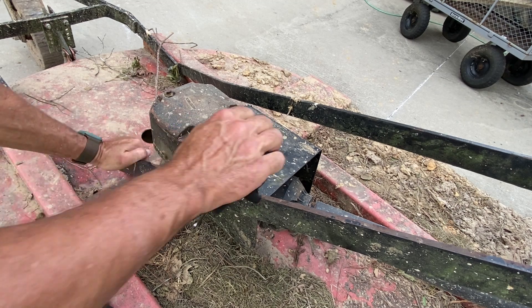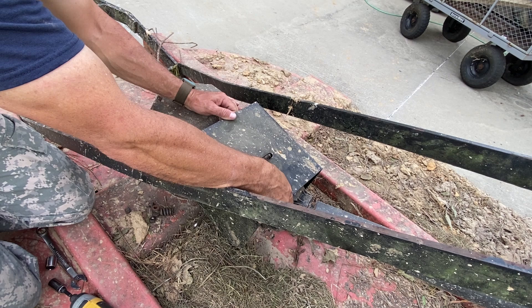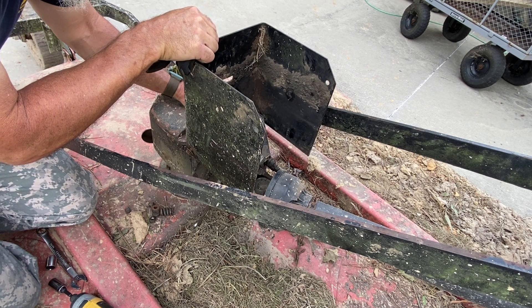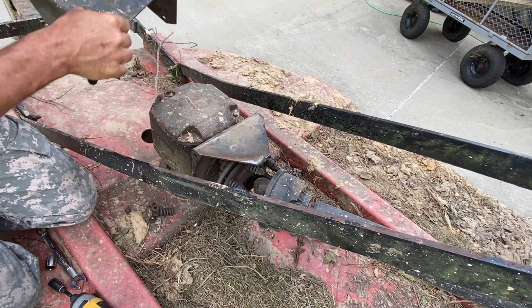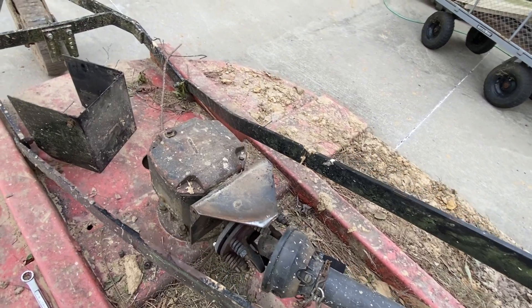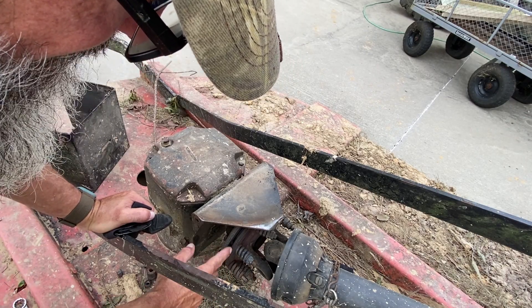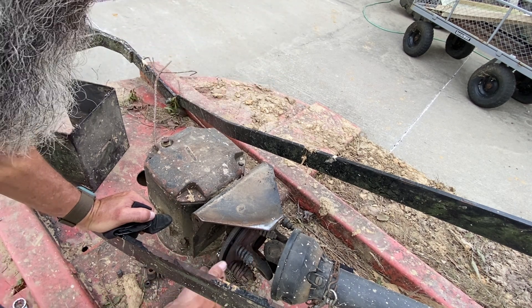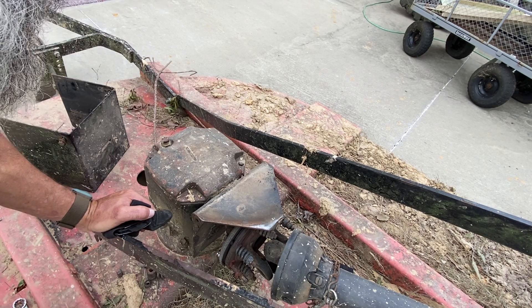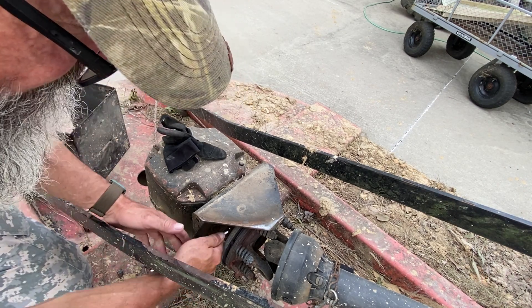First thing we're gonna want to do is remove the protective housing. I've already unbolted it — this housing just sits here and clips down. You rotate it up to access in here, but it's always in the way. It's held on by two bolts and nuts, size 9/16ths. We also need to remove these nuts and springs for the pressure plate to access the disc and the linings. I'm ordering all new springs and hardware while I'm digging into it — size 5/8ths for those.